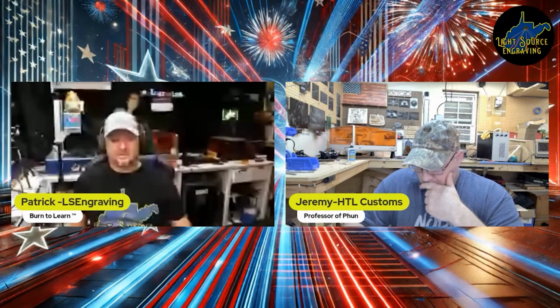Yeah, it is. I've done one before. If I can find a picture, I'll pop it up on screen. But it turned out great. But it was a vector that I did and converted to 8 different layers. So I had 8 different vector layers on this big coin, and it took hours to run. And then I shaded each layer differently with the laser. That way I didn't have to polish it or do anything. And boom. Turned out great. That's pretty much it, Jerry.